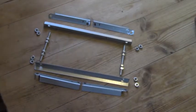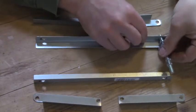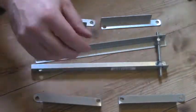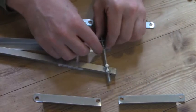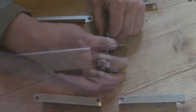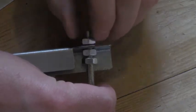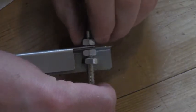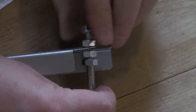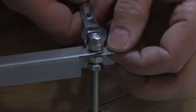Here are all the drilled parts ready for assembly. I begin with the hinges. The hinges are the shorter of the two lengths. Put the two sides on and then do up two more nuts either side. Now the nuts lock together either side of the metal and create a hinge. You see here — adjusting the nut, get it just the right distance and then put another nut on the outside. Now we're going to lock the nuts together. Locking the nuts together means they don't move.